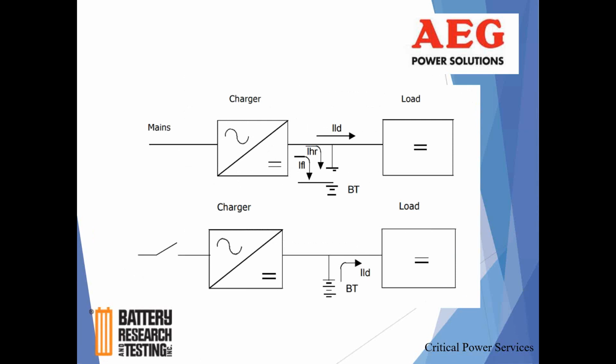So the overall basic operation of any charger: I'll take a step back here and mention that AEG is a European manufacturer of these units. They're based out of Madrid, Spain. So you're going to see some terminology. It'll make sense in context, but what we would probably call AC input, they'll refer to as mains. So they're talking main AC input into the charger. It's rectified DC output going out to the load, and mechanically tied to the load is the battery.